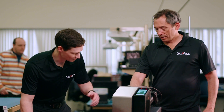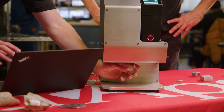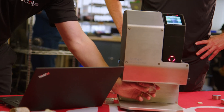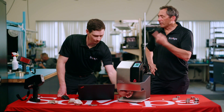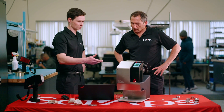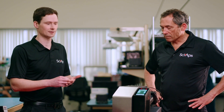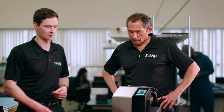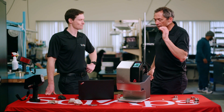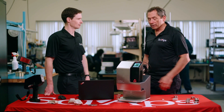Let's do a quick test. You just hold the sample up to this intake tube here and control it with an off-board laptop or tablet. I'm just going to hit the scan button. So it's sucking the liquid in and aerosolizing it — it turns the liquid into a nice spray, sprays it in front of the laser as a fine mist the laser can interact with to get a really good signal. That mist is then carried through the exhaust of the system. It's as quick as that — just a few seconds and you've got your result. No waiting on a lab, no dilution. The detection limit for lithium is about 5 to 10 ppm LOD.